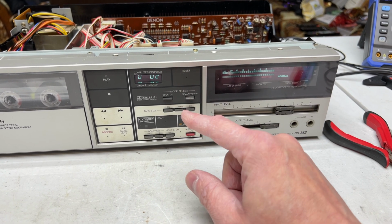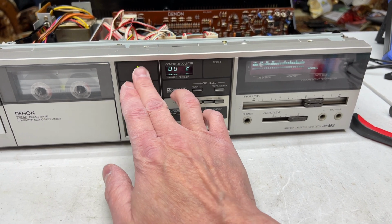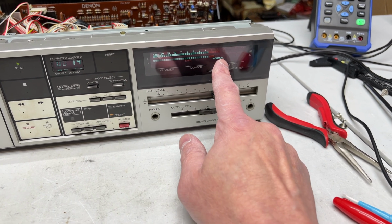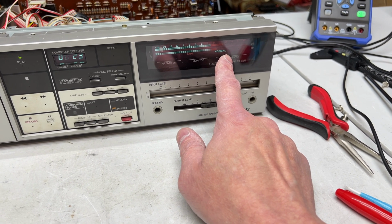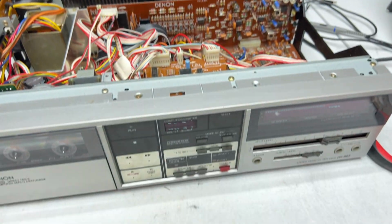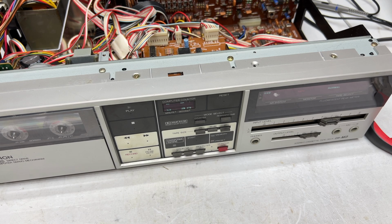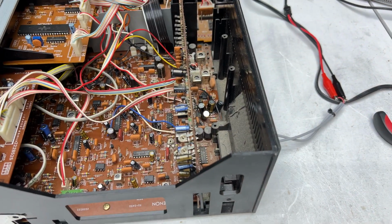I'm not going to bother with the autocal. We're just going to start recording here. And we'll go over to the tape side of this and we'll see what happens. There is more left channel than right now, but I don't know, this is inconclusive. Let me hook up the scope part of this and we'll see if the signal is actually equal there. I've got to set that up again, so... Well, no I don't. We can do the signal trace idea with this instead.